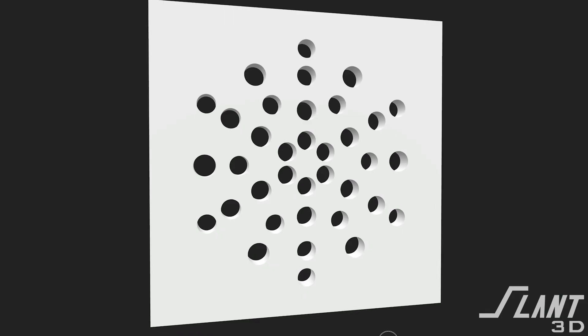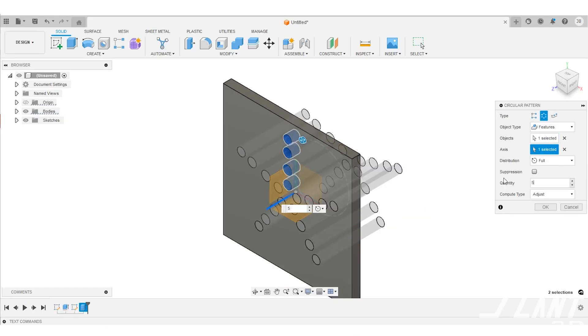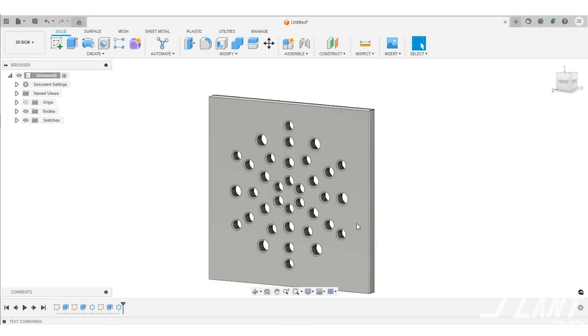This is a fairly typical fan vent cover design — a bunch of holes popped through a single plate. Traditionally it's a good way to do it, even though it creates a lot of pins inside a mold. But this is a very complex design to print for what is a fairly simple part. With 3D printing, you want to avoid what are called islands. As each layer line goes up, you don't want to stop and move to a different place repeatedly. Each cross section of these holes looks like a bunch of little mountains, which can introduce errors, stringing, and additional post-processing.